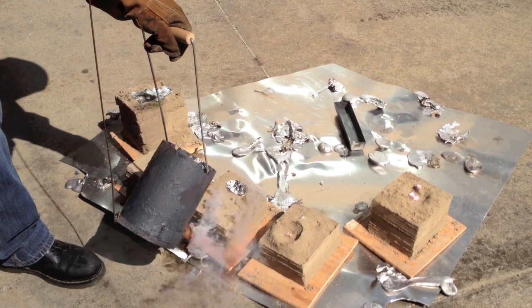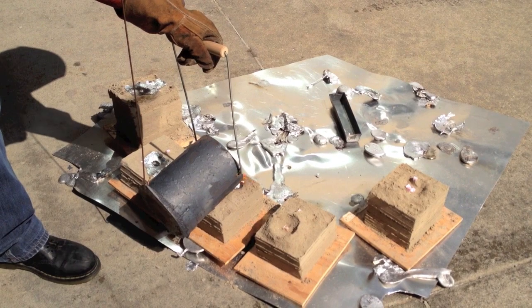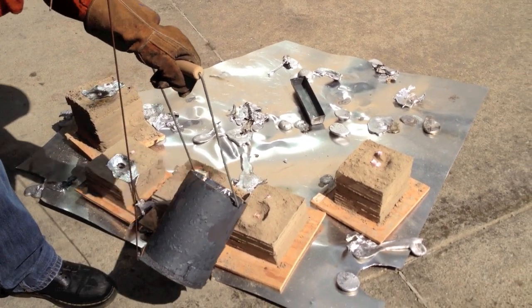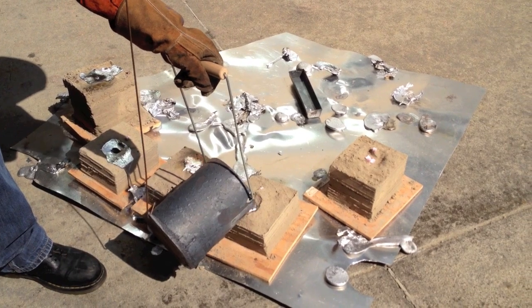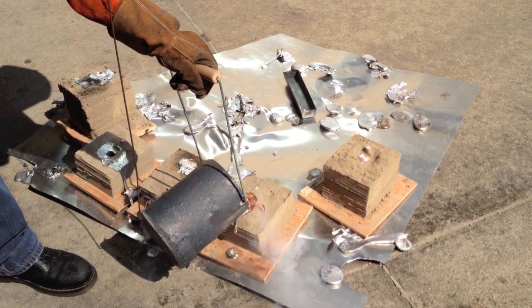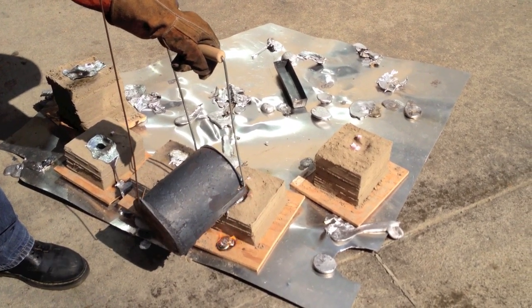On some of these molds, I stop pouring and wait for the foam to melt, and then continue to pour after the foam has melted. This isn't the ideal way to pour. It is best to have a continuous pour throughout the mold. To do this, one must create a pressure head tool that acts as a temporary reservoir of molten metal until the foam melts.